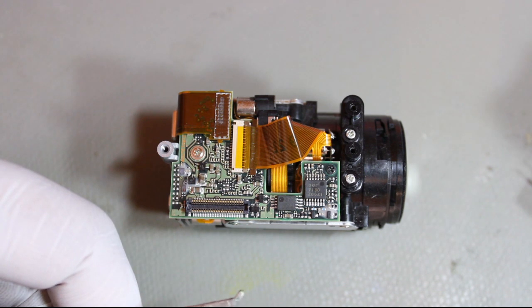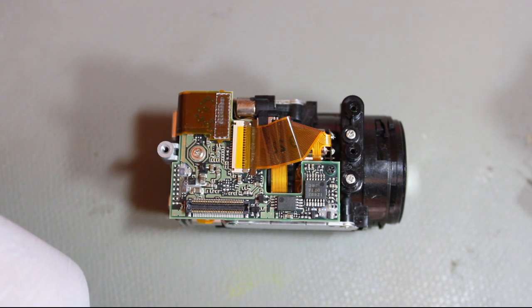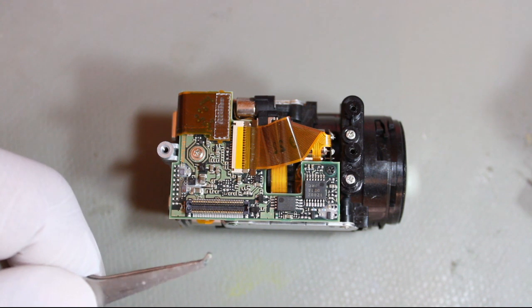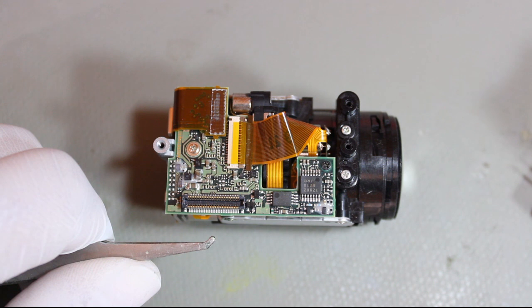The camera has a 16-bit output. It directly supports YUV out, which you may already know. UVC also directly supports raw YUV format. Camera output is a 16-bit bus, a pixel clock, an H-sync and a V-sync. There are some oddnesses in the interface which I'll talk about later.